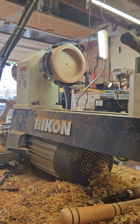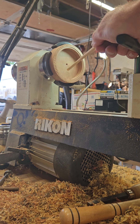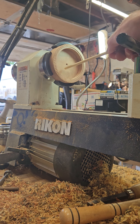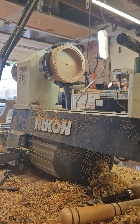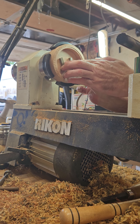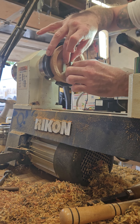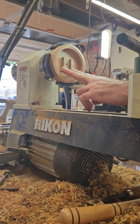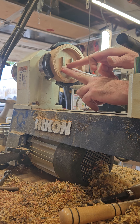I take a three and a quarter inch Forstner bit and I bore it down. A couple videos back, I said I have a new set of specs that I've been doing inside my calls. Normally I would run a solid pedestal circle inside here. But the last probably eight or so calls you've seen on the channel, I've been running two rails, which opens the call up and I'm getting more realistic hen sound out of my calls. And that's why they've been sounding so good.